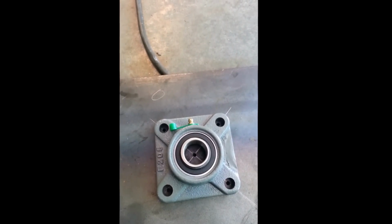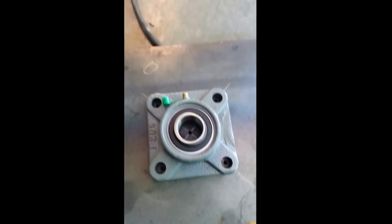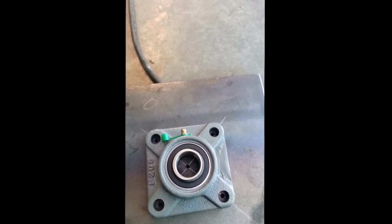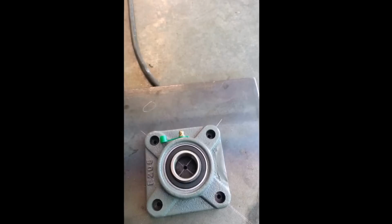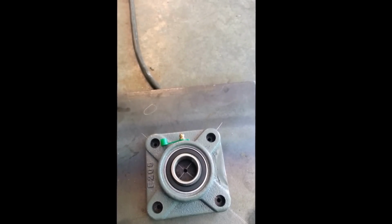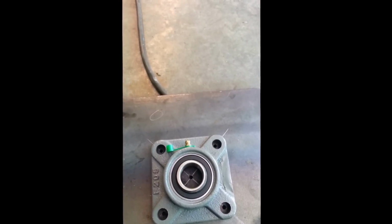and drill out that 1-inch hole there. I'm going to drill it out slightly larger than 1 inch because I want that shaft to fit through into the inner race of that bearing and not obviously contact the plate. But I don't want to make it too big either because I don't want to get crud caught up in behind the bearing. So this thing's going to be pretty close to 1 inch, maybe 1 inch 20 thou